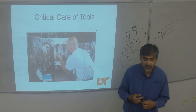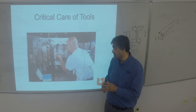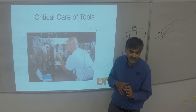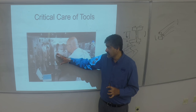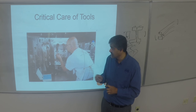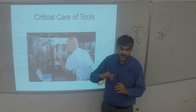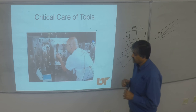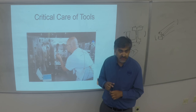Sometimes these people work under extreme stress because the tool is shipped overnight and they have to turn it back the same day. There's a lot of detail in understanding whether it should be welded — if there's a pit, you can weld it, clean it, and bring it back to shape. There is a lot of welding that accompanies this, and additive manufacturing is now making its way in tool repair as well — quickly additively repair patches to get past your production run.